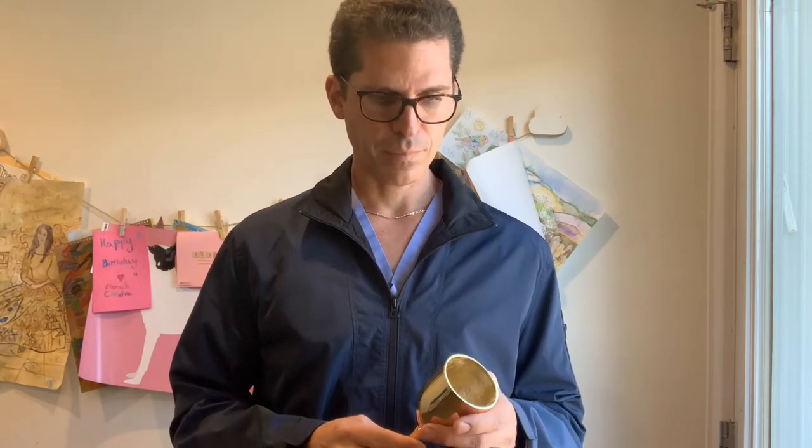In this video I'm going to show you my third attempt, which was ultimately successful, in creating a brass goblet using the lost PLA technique. To do this I had to create one kiln for heating up the brass, and I bought something called naval brass because I needed something that was lead-free if you're going to drink from it. I also had to have a second kiln to burn out the PLA.